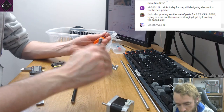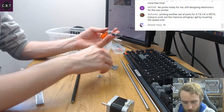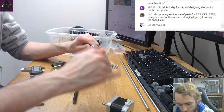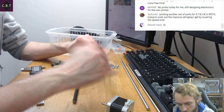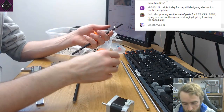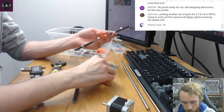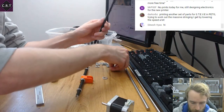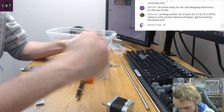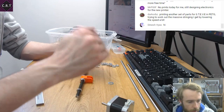The second thing — from pretty much day one I've wanted an option for MGN12 rails. The downside I haven't found a good way around yet is that you can't really use those rails with the enclosure, because I went for 2020 extrusion and the MGN12 carriage is slightly wider than 20mm — so if you mount them on those rails it doesn't really work out in your favour, which is a bit irritating.